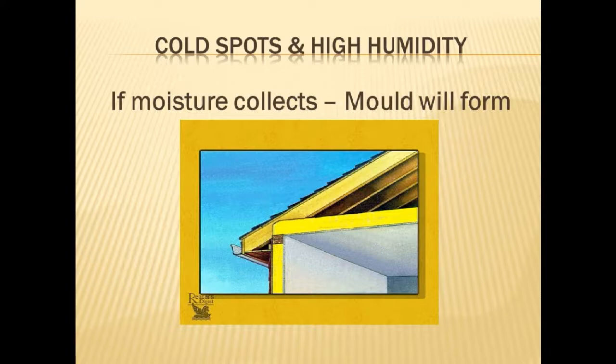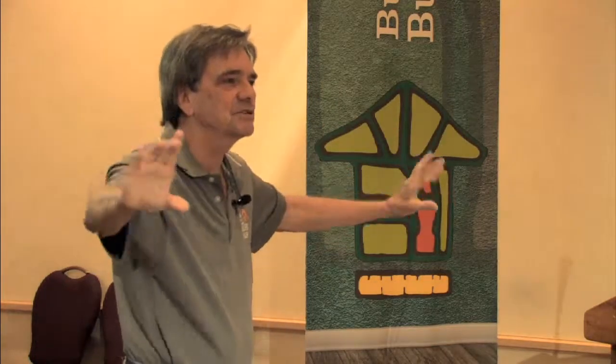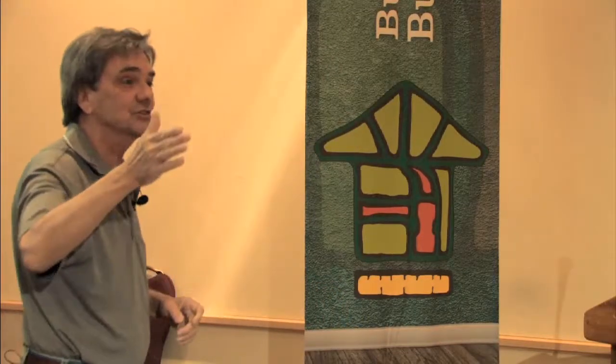So if you don't have insulated sheathing in a retrofit situation, a lot of your old houses are built exactly like that. Open the soffit and put about a 6-inch strip of styrofoam against the double header. It's up above the soffit. You don't see it. You don't have to do anything with styrofoam. Just put it in there. Glue it in place if you can. Okay? And cover that piece of wood, and you'll find the mold disappears on the inside. One little retrofit trick that we've done.